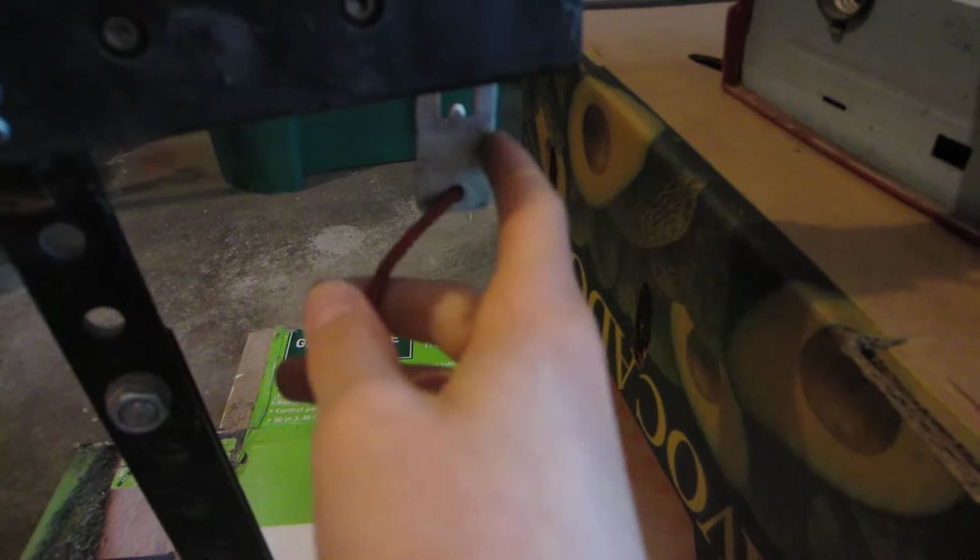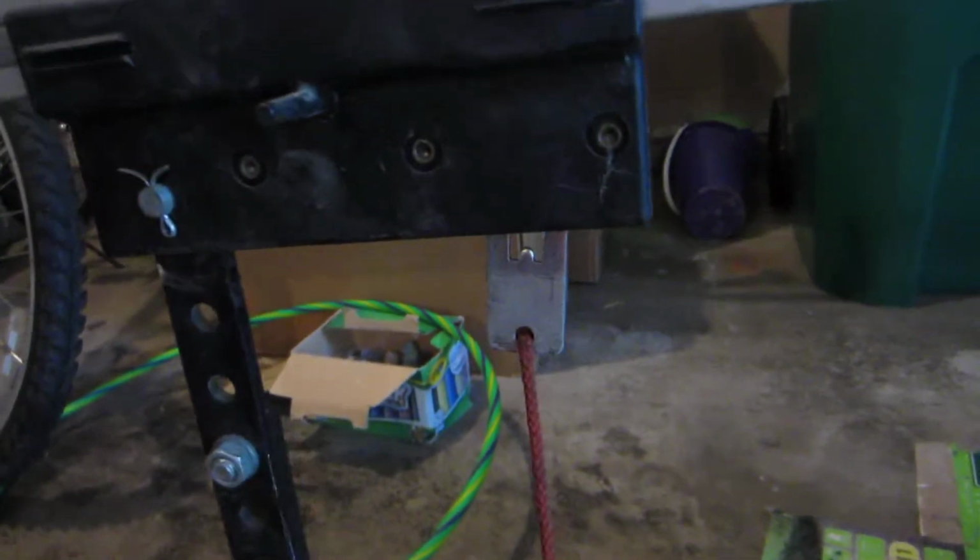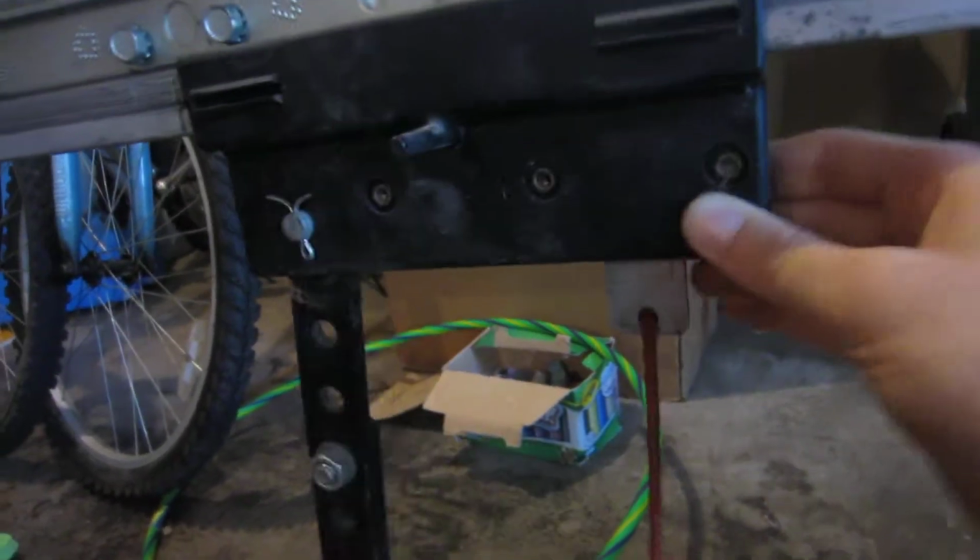Now, here's the trolley again. I can do this with one hand now, but to disconnect, you pull down on the cord, down and towards the door. You can also do it, it doesn't have to be toward the opener, but then it'll slide back and forth. And I was putting this together, and I wanted it engaged. It was like right here, so I pulled on it like this, and realized that it was still sliding around.